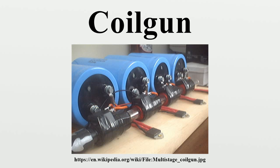In a multi-stage design, further electromagnets are then used to repeat this process, progressively accelerating the projectile. In common coil gun designs, the barrel is made up of a track that the projectile rides on, with the driver coils around the track. Power is supplied to the electromagnet from a fast-discharge storage device, typically a battery or high-capacity high-voltage capacitors designed for fast energy discharge.